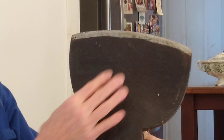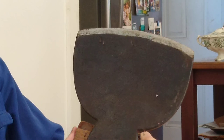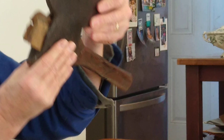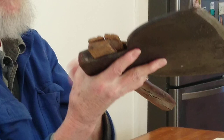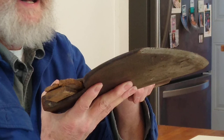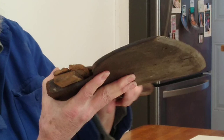The iron axes are made butterfly style — they're open on both sides, folded up against the steel edge and welded to that steel edge. You can see the welds. An interesting thing about this axe: it does have a bent handle, and the handle is designed to go in from either end. There's a wedge I can knock out easily and put the handle right into the other end and turn it over. The assumption is this is for left-handed and right-handed hewing, but I don't know that. With any given head, I assume there are four ways to hew — two ways with the handle in one end and two ways with the handle in the other end.